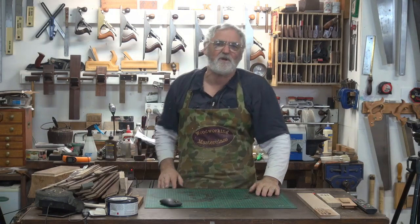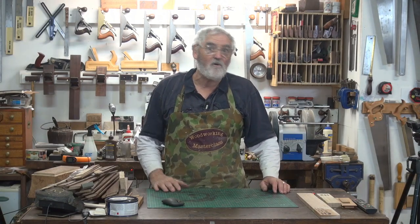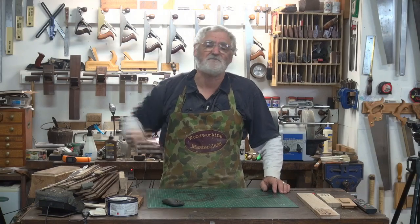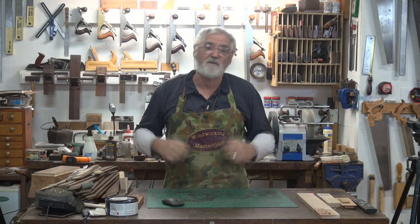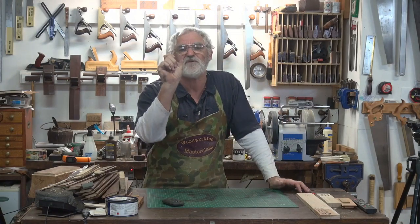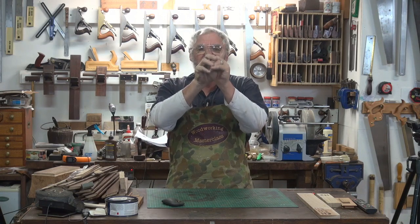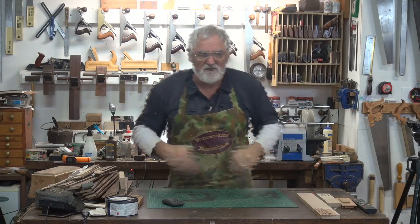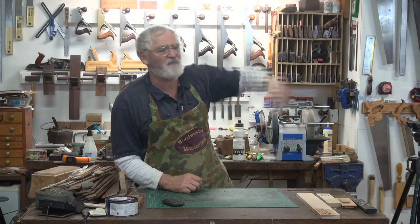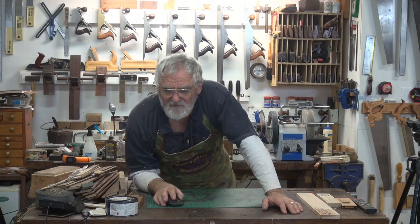Mate, if you've got a Sherwood lathe, leave the pulleys, just go to either a radiator place or Supercheap or a pulley place, and they have a huge range of belts. Just get the belt that fits it. It might be a bit smaller, which means you just have to bring your tension in a bit, or a bit longer. But what you've got to look for is whether it's an A, a D or a B, what sort of belt, because some of them come down in a V, some come down with sides and a wider base. Just take it along to the radiator place, mate. They'll have belts hanging up on the wall. Not a drama. Or it might be written on the belt if it's not too far gone.